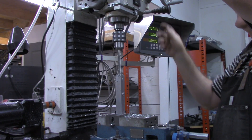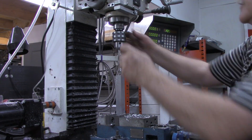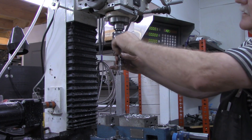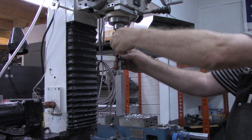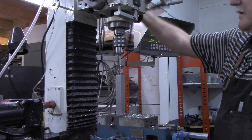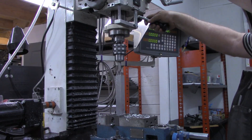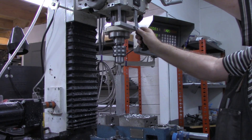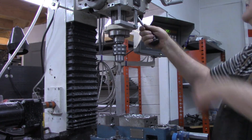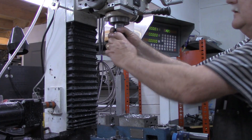That is the extent of my quill - three-inch quill on this mill. With all the chips cleaned out, I'm going to drop the bit down to where it still has a good reasonable amount in the chuck. I would love to get at least another half inch from where I'm at now. It's registering 2.04, two inches. Let's see how much we can get before the bit completely clogs up. That's another half inch. I'm going to have to clean those chips out a little bit.